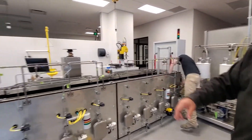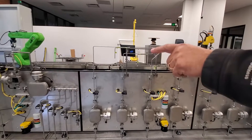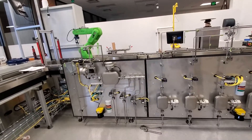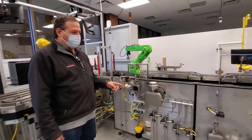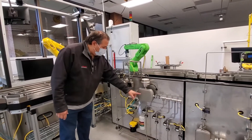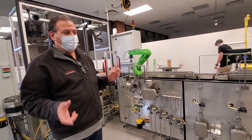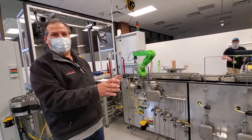These are the liquid filling stations — there are actually three. You can see the flow meters; these are all Endress+Hauser Coriolis meters. There is one meter that's different: this is a mag meter, and this is a Coriolis meter — you can see they're in line with each other. The reason we did that is so students can see the differences in precision between the two types of measurements. Because of the low flow rates, these are the only kinds of flow measurements that can actually be done, other than positive displacement.